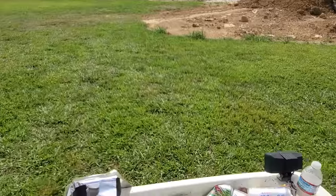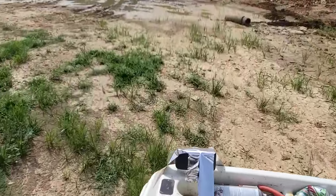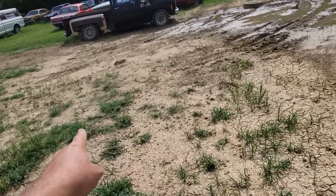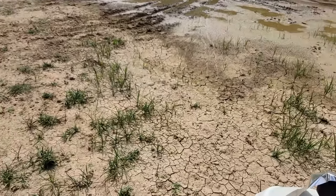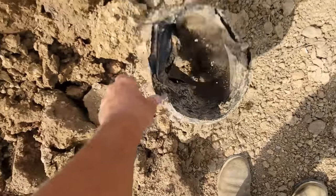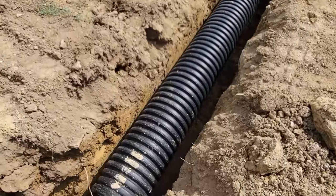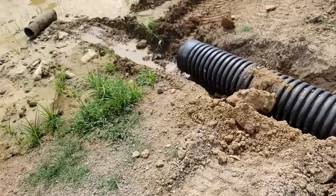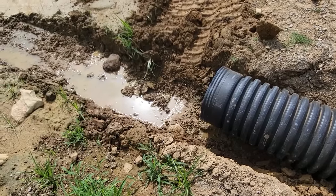It works good. It's been over a hundred — like 105, 108 degrees. So a lot of this is dried up. Normally we had water just sitting here, but you can look at the grass — it just never went away. It just sat down here and swallowed up a bunch of my rigs. So we're redoing this as well. Here's the old pipe. We upgraded — there's the new pipe. So we're putting 18 inch in now. The whole thing is it's got to get set up correctly right here. This side of the pipe was too high and nothing was actually flowing into it. This all needs to be graded differently.